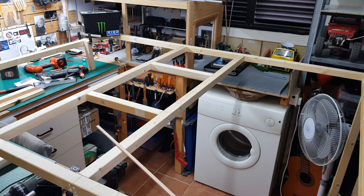Before any of the woodwork happens, I need to make sure the frame is in the right place. I have to take a plumb line from the ceiling to each corner to locate where I'll be installing an enclosed hook — an eyebolt — for the rope to tie onto, and drill the ceiling for the hoisting mechanism. If I do the surrounding wall first it will block my access.